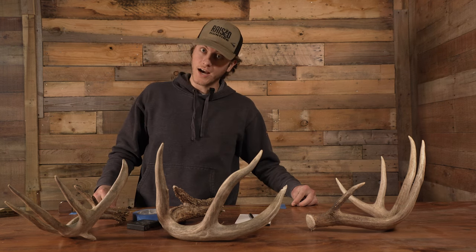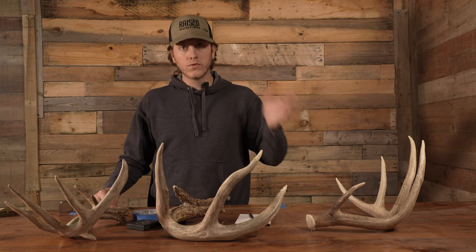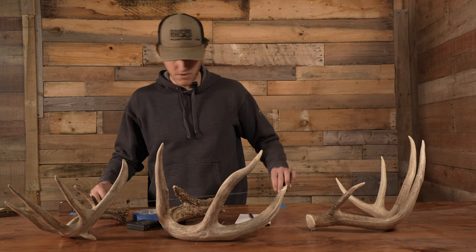So a little tip for you guys, don't use it exclusively, or take advantage of it. But if you're over an eighth and you get the 16th, the next 16th. So in this instance, I'm at 7/8, 15/16 is the next line. I've got the 15/16. It gets the next eighth basically. So instead of this being a 22 7/8, it's going to be a 23-inch main beam.